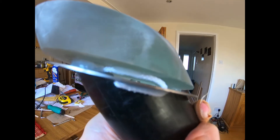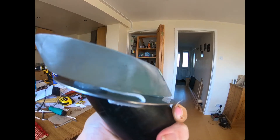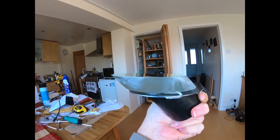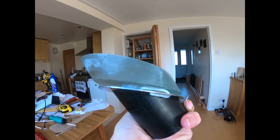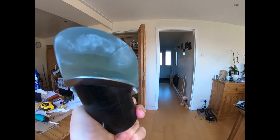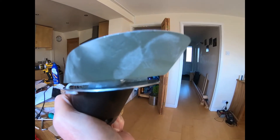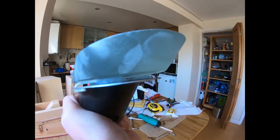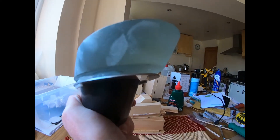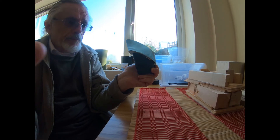The string is not tight — it's quite loose, because you don't want to stress the mirror. Although this is a two-centimetre-thick mirror, you do not want to stress it in any way, because the tiniest bit of uneven forces on it and it will bend. My hand's getting a little bit tired here, so I don't want to drop anything — put that back there.